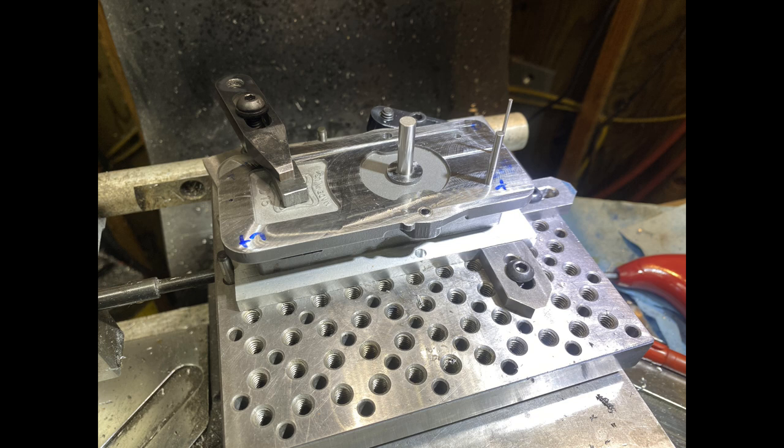When I said it failed — I had to cut the slots in for the bottom of the vice for the keys. I had already cut the two in the Y and the far one on the X to the right. Now I moved over to cut the one by the clamp, made my first pass from outside towards the clamp — everything was fine. Dropped down ten thousandths, turned to come back, and the end mill bit threw the part out of the vice. Those pins on the right were not installed. So I had to go back and get everything realigned on the bed again before I could continue.